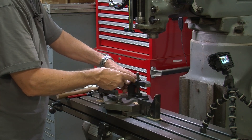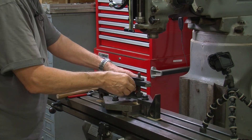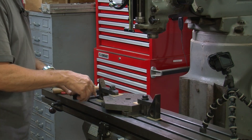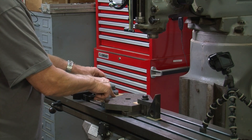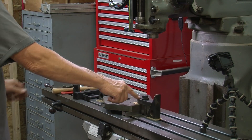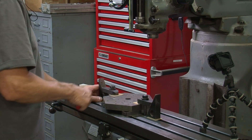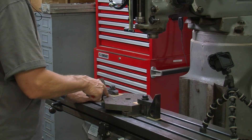Try to make these as flat as possible. On this particular setup I put aluminum shims between the table and the block, and between the work piece and the clamp. The reason is that these clamps and these blocks are very hard and they can actually damage the table — put little dings in it — especially if you're working with a piece of aluminum or a cylinder head or something like that. You want to use something soft there.